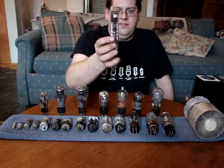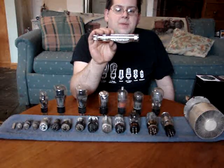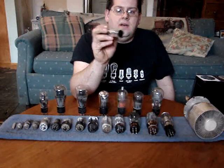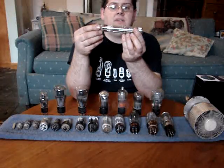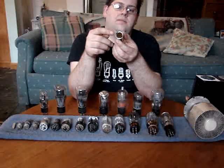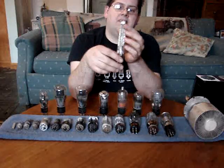This is a very complicated tube. This is called a Vidicon tube — it was a predecessor to modern video cameras. This actually picked up the image through the lenses onto the face of the tube, and it works opposite to what a CRT does. It actually changes the image into electrical signals, which were then sent out to be edited and processed.